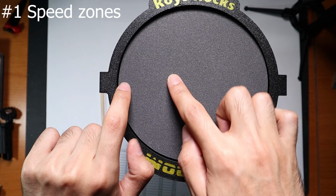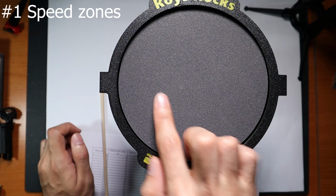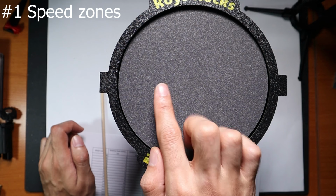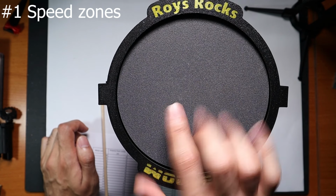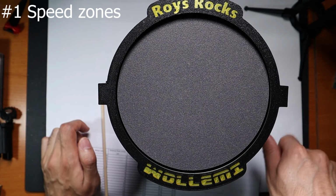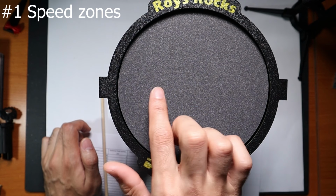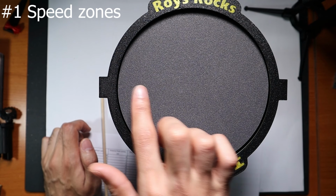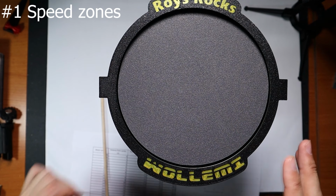So you really need to get a grip on where you're comfortable grinding, but you also don't want to grind in one set spot. So it's great when you've got a machine like this where you can vary the speed. It means you can make the speed of the surface here and here the same just by turning up and down the potentiometer. And then you might carve a stone in here, the next one you might do over here, the next one you might go further out over here, if you can eyeball the speeds pretty well. But that trips up a lot of people, so be careful with that.